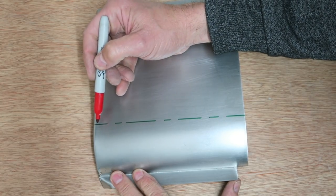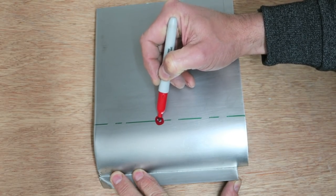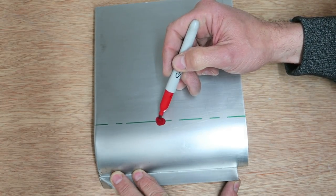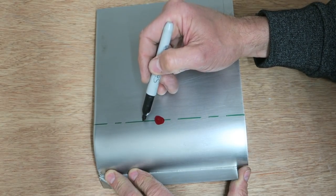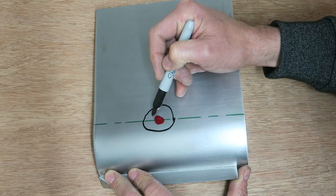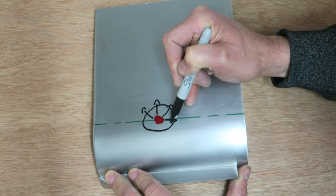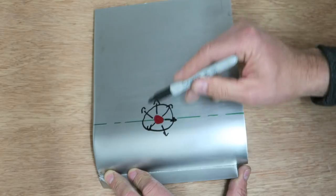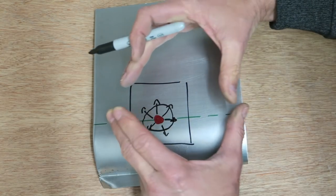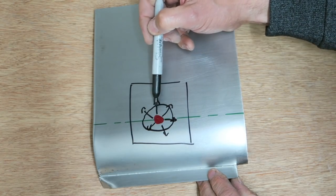Going back to the panel, as you were welding along your welded joint, you would have a heat affected zone, which would be a spot like that where it's glowing red hot. Of course, this spot here is super hot and malleable, so this is where the most amount of action will be going on. Surrounding the heat affected zone will also be an area of great compression, and this will also shrink. This is because all the forces are initially kicking outwards, so it's always trying to expand out away from the central zone. This panel is acting like the piece of apparatus. So this here is the expansion block. This whole panel is preventing the expansion from going anywhere else and creating thicker material in this area.